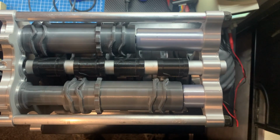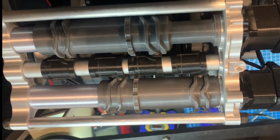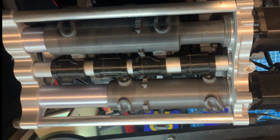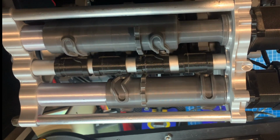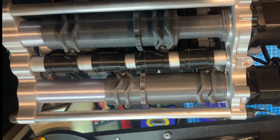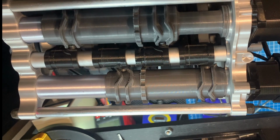So I started off with essentially no delay in the shift barrels, meaning they both started moving at the exact same time, so 100% overlap. And it actually worked really well. It would get through probably 2 or 3 complete shift sequences before it would finally lock up, and that's due to probably just a slight delay or a slider getting caught up.